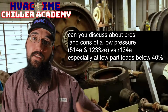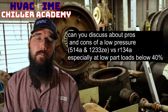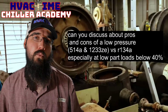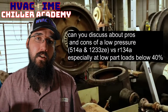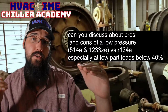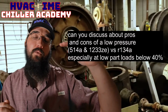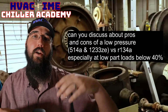So the refrigerant condenses, non condensables don't. They stack on the top of that little heat exchanger. And as they stack up, we can use a few different methods to determine when it's time to kick on a pump out pump, which literally sucks the non condensables out of the machine and pumps them out into the atmosphere. We can either use the evaporator pressure compared to condenser pressure.